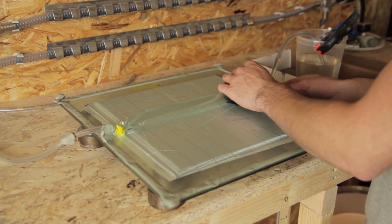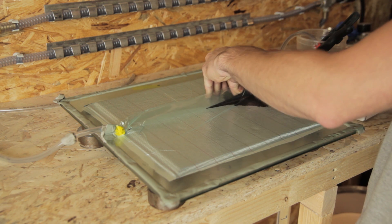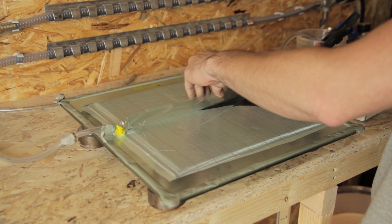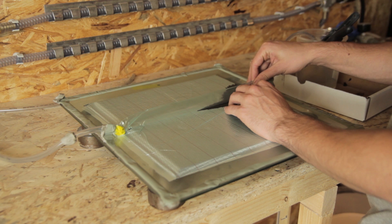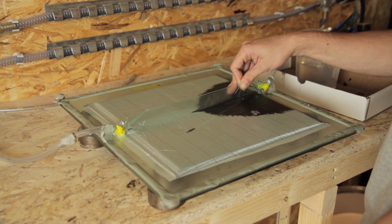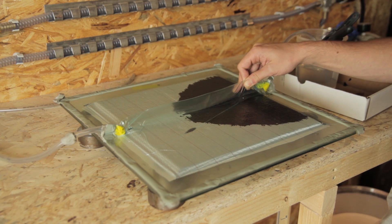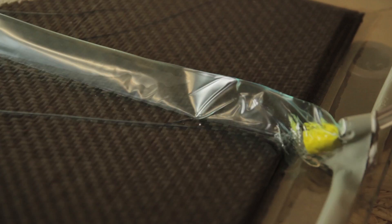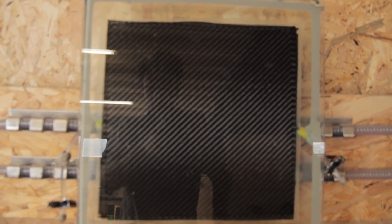Here's how you can help solve that problem: at a failing infusion you will see a pull-up of resin at the beginning of the resin front. By lifting the bag — because you have less vacuum at that point — you will be able to let the resin flow even faster through the part. This is how I saved this infusion. It was planned to fail if you didn't know this trick. You can see that lifting the bag pulls all the resin all the way through and gives you a good result.